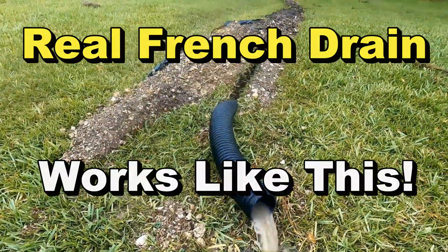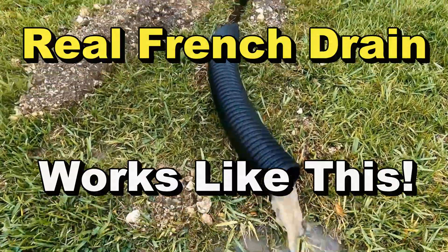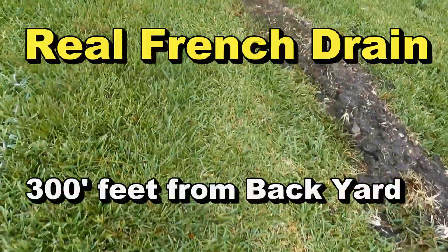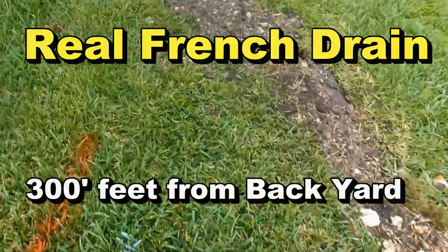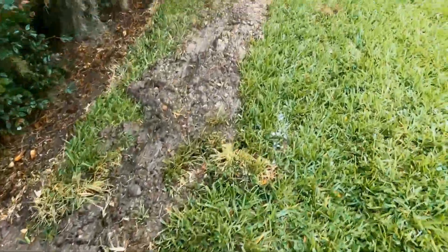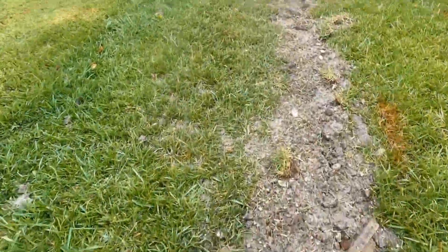Look at that — a quick downpour. This is coming from the French drain in the back. Remember why we're installing this: there is a low spot way back here by the pool equipment, and it's negative grade, so we had to dig through grade all the way out to the front to get this area to drain. And you saw that water come out — it works. We're pushing water through grade nearly 300 feet.